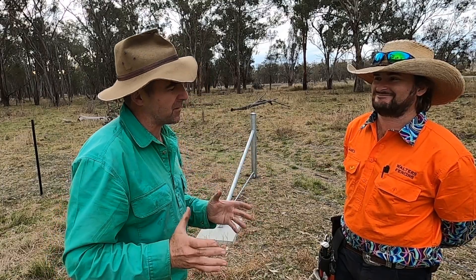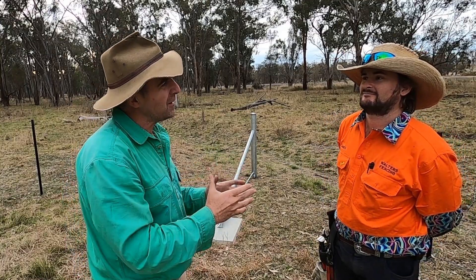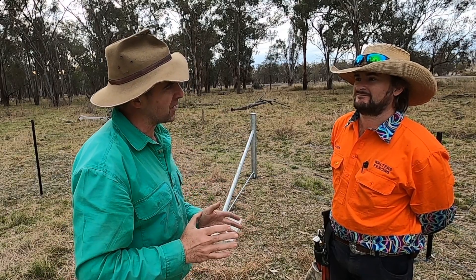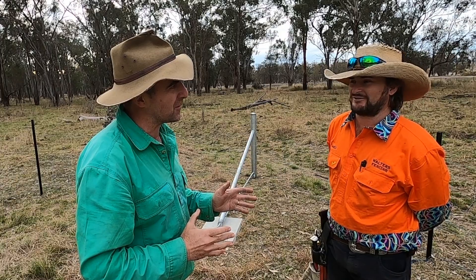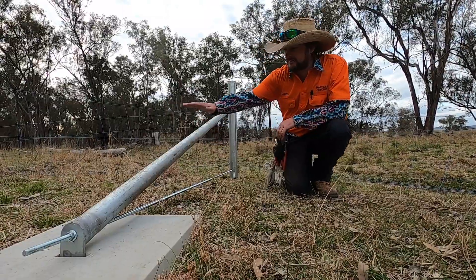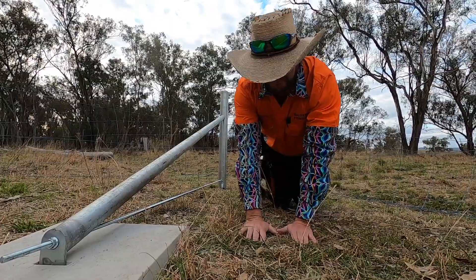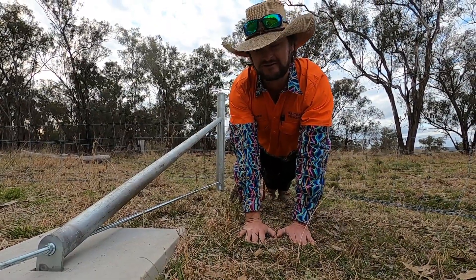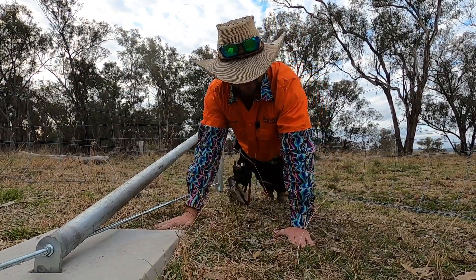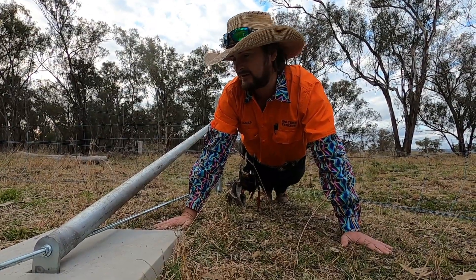You've got a basic physics theory as to why you prefer to have a single stay into the paddock rather than two stays along the fence, and you can explain that with push-ups. This is our single stay into the paddock and this is my attempt to do a planking manoeuvre. As you can see I've got both hands pointing to the ground and I'm well supported — this simulates a single stay into the paddock. As soon as you start spreading the angle out it becomes increasingly harder; gravity takes over, or in the case of a fence, it pulls out of the ground.